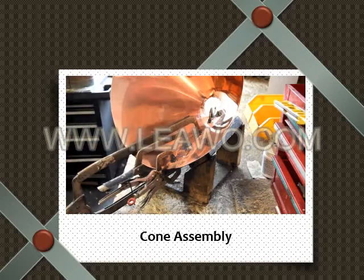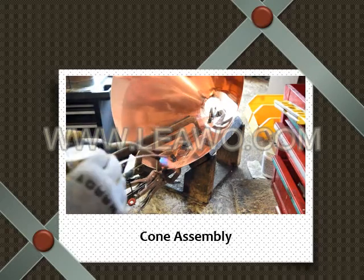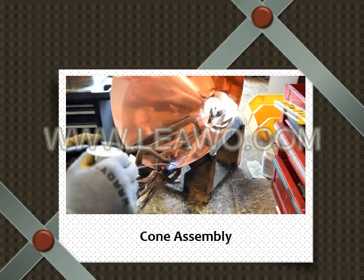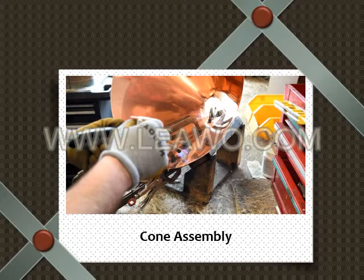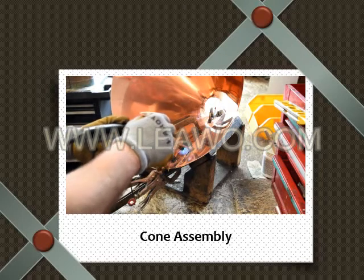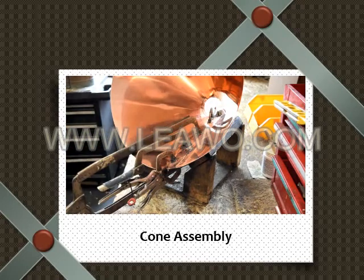The first run up the whole way is just to fill it as much as possible. I'm always telling the guys, push, push, push it in there. You want it dripping out on the other side. That's why I laugh at these guys, our competitors, when they say, oh, look at those solder drips. You want that dripping on the other side, making sure that it's full as much as possible.